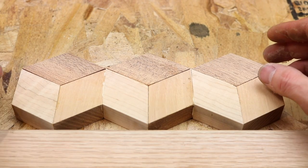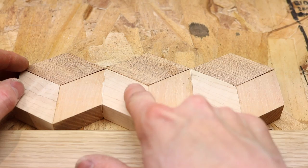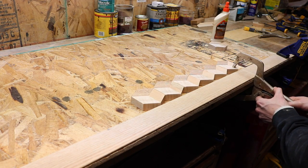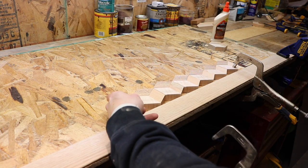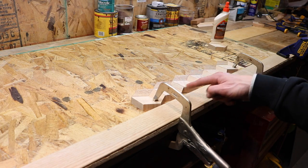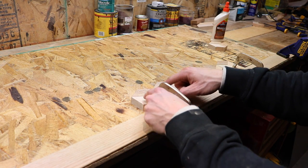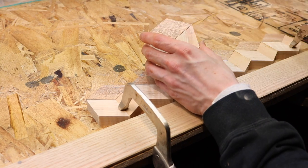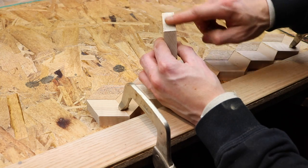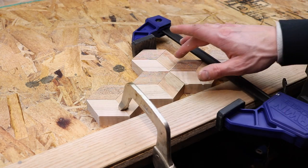While we're doing this, we're going to make sure that every part of our chevron — which is this part here — is touching our straight edge. Go ahead and push tight on the end of that, then put a second clamp on the other one. Be sure if you're using C-clamps like this that you're not applying too much pressure, as it will dig into the wood. For our top row, we're going to put a little glue on the bottom pieces here, then take our clamp and apply just a tiny bit of pressure.